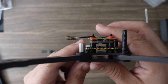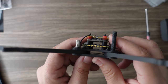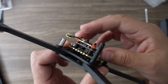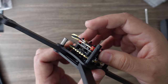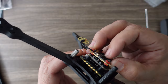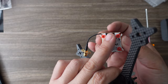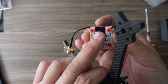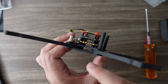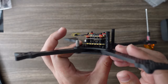The Ghost has a flat side on the bottom so you can lay it very close, kind of resting on the harness. Make sure there's clearance for the USB — no metal touching metal. This USB is very close to this board, so I checked for any metal connections. There are a few pads, so I covered it with a little Super 33 electrical tape just in case it's ever compressed and makes a connection — it won't pass any power to that USB port.